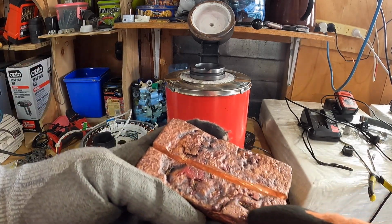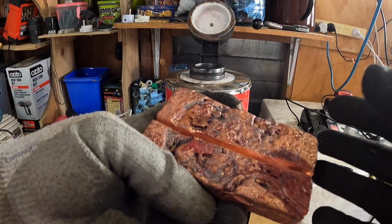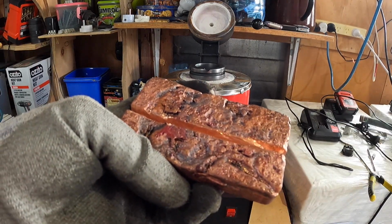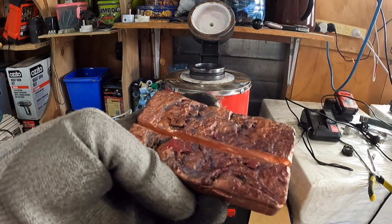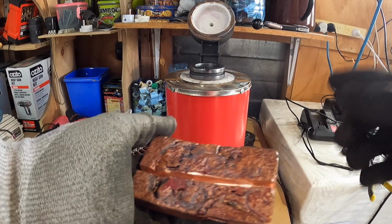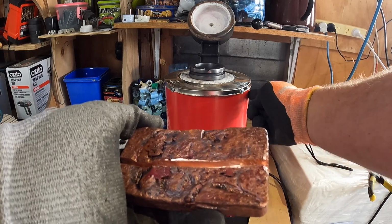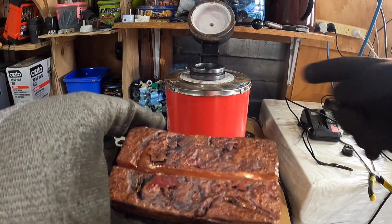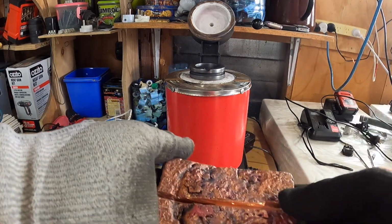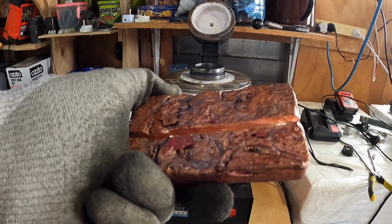Now, for some reason it's not nicely melted, because as I say, it's cooler on the top than it is at the bottom, obviously, because that's where the heat source is. And the other thing is that if you add cold copper to warm molten copper, it will freeze, or it'll cool considerably. And because the temperature at the bottom is hotter than at the top, the convection current, when it freezes at the top here, doesn't quite work the same. So you have to stir it, and you always need to heat your stirrers to stop steam explosions and the hot copper adhering to the cold metal.